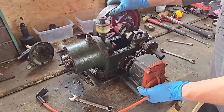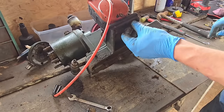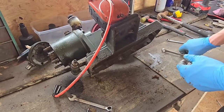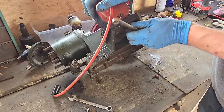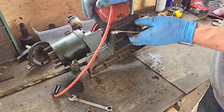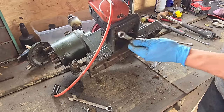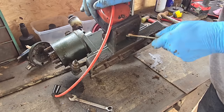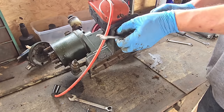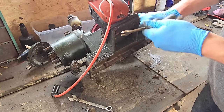I think we've got to see about getting the magneto off, which will be these ones here — it's held on with four bolts, not just two. They're nuts. I thought they would have been bolts going into the mag, but they aren't. Am I worrying about timing the mag up? No, I can do that by eye — so don't worry about that.